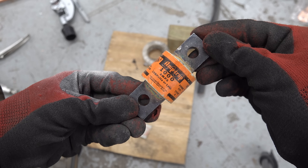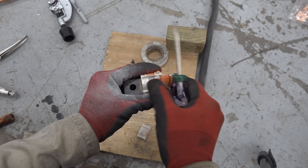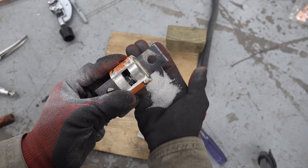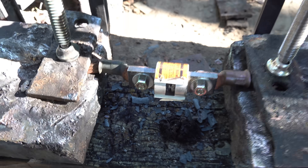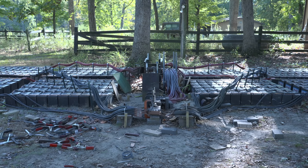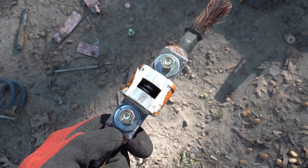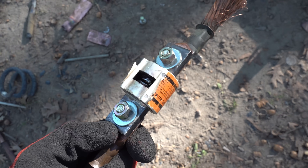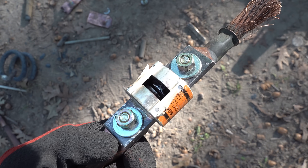Here I have a 1,000 amp fuse, and I'm actually going to cut it open first. That way we can at least see some sparks when it pops. This fuse looks to have parallel elements inside. I hope this one is more exciting than the last one. Nothing to write home about, but that vivid green flash was pretty neat. I can see the burn through there was a lot more complete compared to the last one. That's probably just because I got rid of all the sand inside.